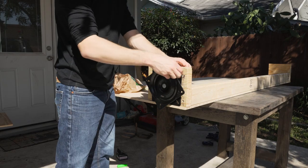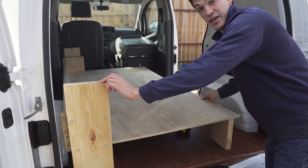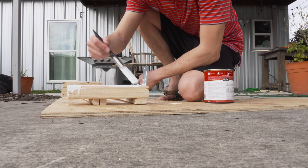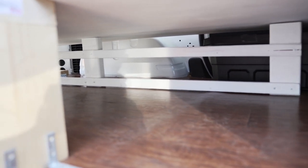I just used the frame for the bottom half so that the mattress would stay in place and not fall every time I put the bed up into Murphy mode. I used a couple pieces of 2x10 wood and bolted in the back side of the swivel seat into that on both sides. For the bottom of the bed, I used a piece of 2x4 cut to the exact length of the bed to keep the mattress in place. I also used a heavy duty gate latch secured to the rear support to keep it in the up position. The floor of the NV200 is not perfectly level, so I had to cut the 2x4s to different sizes to make the bed level — I definitely made some mistakes and had to re-cut a couple of times.